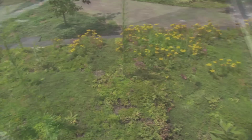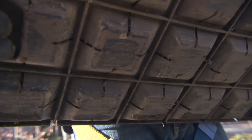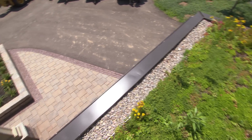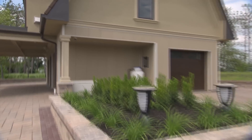You can see it — this is really growing in now and it actually looks like it's on the ground. They have a weeping bed underneath this, so we have a membrane down on this flat roof. Once it rains and water gets through, it drains — the overflow goes down to the scuppers, right down to the downspout and into the cistern tank.